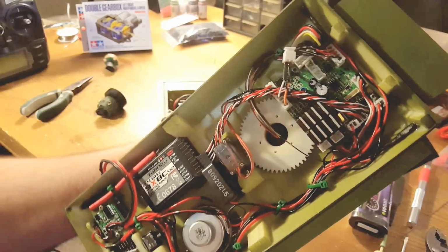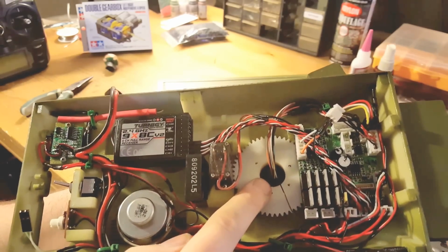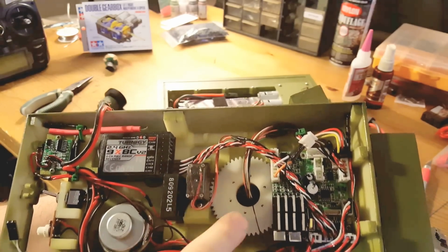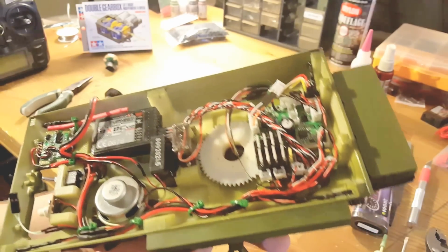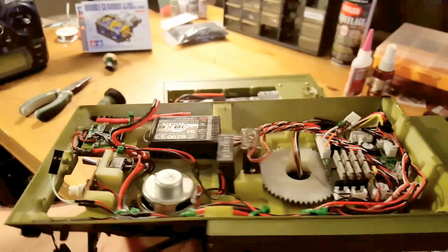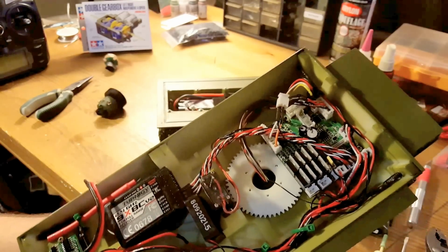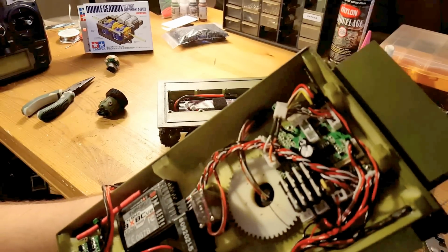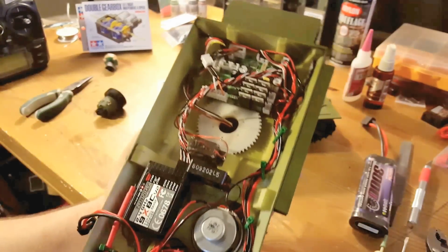servo for rotation. I bought one of these 12-wire slip rings from China, so it gives it 360 degrees, and that's the exact amount of wires you need for all the functions up here, 12 wires. And the servo you have to modify for 360 degree rotation, which is pretty easy. There are videos and stuff online for how to do that. And everything looks kind of greasy because I sprayed some Corrosion X in here. I probably sprayed a little too much. It was leaking everywhere.